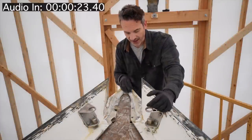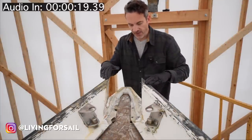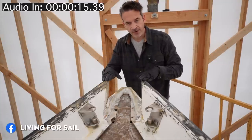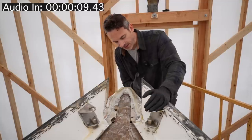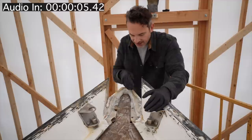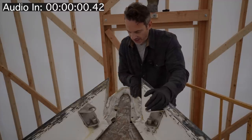With all the old core material out, we're ready to start planning and preparing to put new materials in. The original boats had the stem head fitting mounted above the bulwarks. It looks like the later models have the bulwarks cut away and the fitting lower to deck level. It's no doubt a more solid mounting location, but I suspect the mold wasn't changed much. There's some pretty serious cracking on the sides of the bulwarks here — I'm going to need to take a look at that.